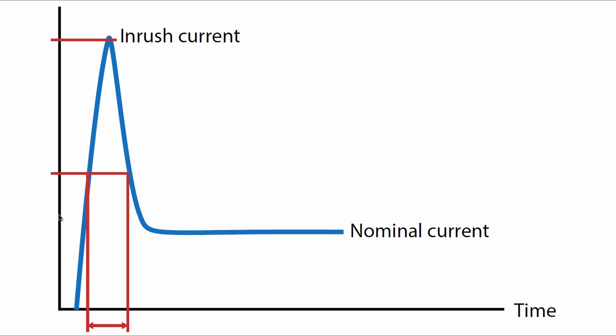So why do we need pre-charge? The inverter has huge capacitors, and when we turn on the voltage that will generate a really tremendous inrush current. As you can see here on this graph, the peak inrush current will exceed nominal about three times. We need to limit this inrush current because otherwise our contactors will be damaged. For this purpose we use a pre-charge resistor, which allows us to limit the inrush current in the initial stage of the pre-charge.